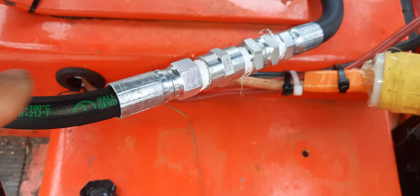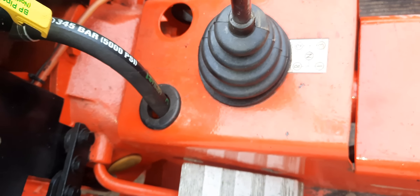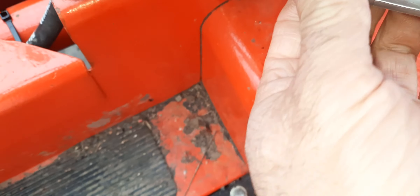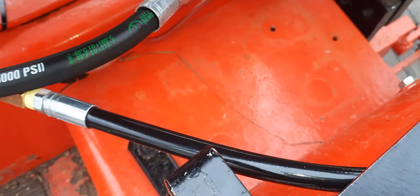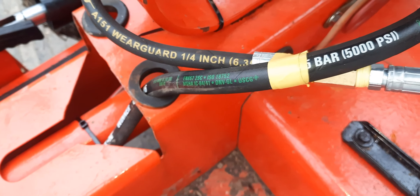Now on the other side — this is the line that goes into the pump, it comes up right there. This is another one of those snowplow lines, and that's what's wrapping around. I have this connected here with a coupler that I'm going to break apart, and right here is where I'm going to put my hydraulic filter. I don't know if I need it or not — originally they didn't come with one — but I'm going to put one on anyway.